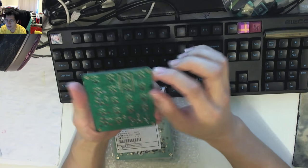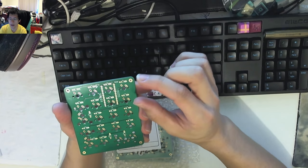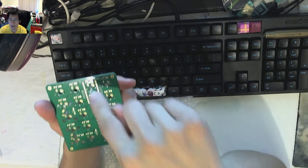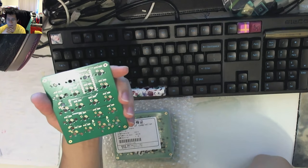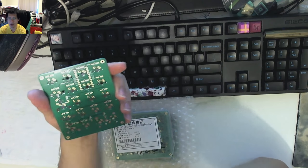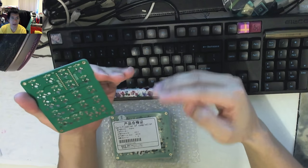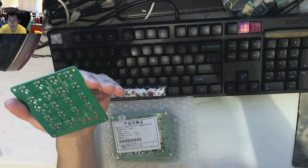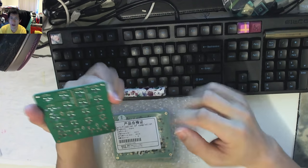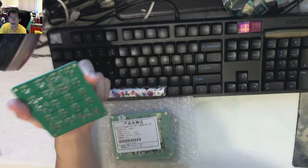when you solder a key switch into this, if the hole tolerances are really big and that switch can rotate, that means when you put your keycap on it, your keycap's also going to rotate. For 1U keycaps, less of an issue, but it will accentuate the McRib effect, so your key alignment will look off, so your caps will look wonky. And if you're very keen and discerning, and some people's sense of spatial alignment is very, very good, that would really annoy the buggery out of you.